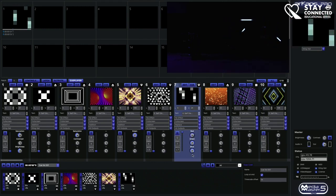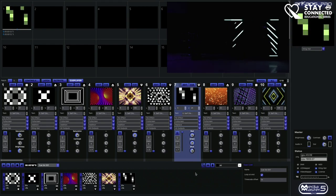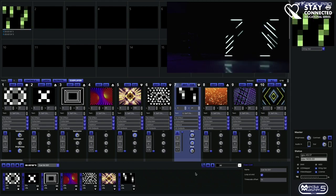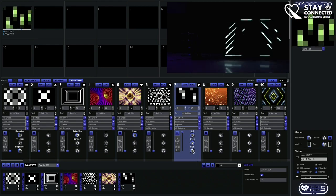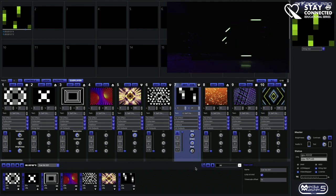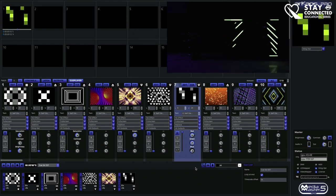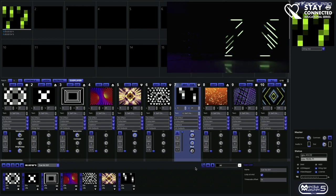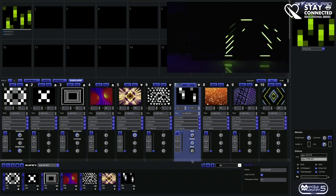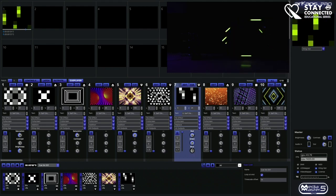But again, you can take a simple black and white graphic. Maybe you just like the way the pattern displays on the units themselves, but you're not too fond of the color. Mediamaster is gonna allow you to change the actual cycle settings of that outputting. So since it is an RGB LED, a 3-in-1 SMD RGB LED that is on the Pixie driver or the Pixie sticks, you're allowed to go through white, obviously the full array of colors. So allowing us to change out one specific value. So here we can almost get like a highlighter yellow going, highlighter green. So, and now we'll just take it back to the plain black and white.